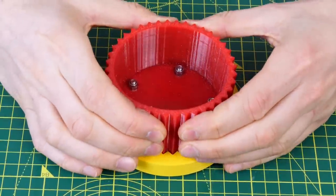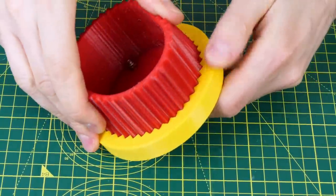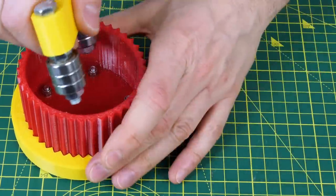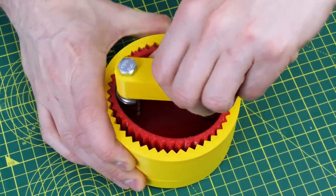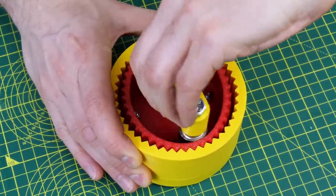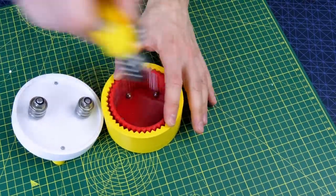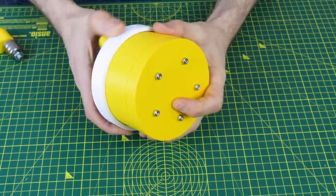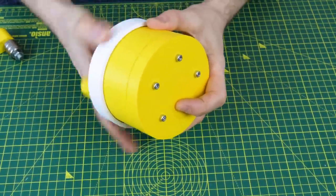This time we want to harness the output power of the flexible spline so it's made like a cup shape and it's bolted into a rigid piece with the teeth locked into a recess. Both pieces are also bolted together with some M4 bolts and lock nuts. My wave generator is a handle with some bearings and bolts holding them, and that fits neatly into the flexible spline to deform it as you rotate the handle. That all fits into a casing and now you can see that strain wave motion as I move the wave generator — if you look closely you should be able to see those nuts moving in the base. I've made another wave generator handle which is round and fits perfectly on top of the main outer casing, making it easier to turn and demonstrate. You can see as I turn the handle that we get the output moving in the opposite direction at a 10 to 1 ratio.